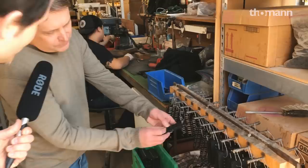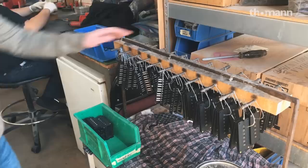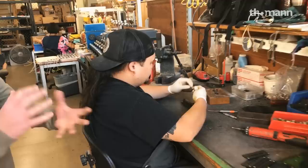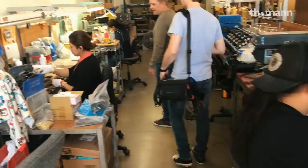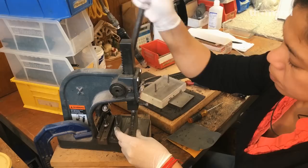These are what we call bobbins, or sometimes forms. It's basically two pieces of fiber with the poles pressed together. They get dipped in lacquer and hung on these things — you can see this is pretty old; it's seen a lot of pickups. With the pickup construction, it's using a little fixture that holds the fibers together. This is how pickups were assembled in Leo Fender's time — we just do the same thing. She's pressing what looks like a five-string Jazz bass JB pickup and pressing in the Alnico slug.